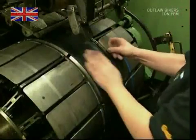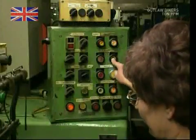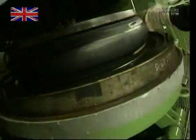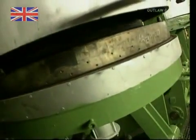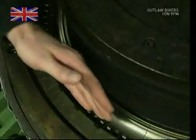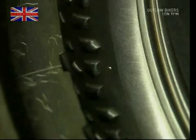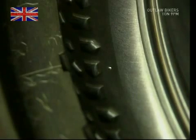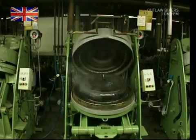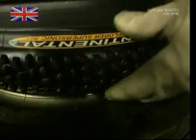But it's still not ready to be put on the rim just yet — first, it needs to be cooked. This cooking process is known as vulcanization. The combined elements are loaded into a machine that heats them up to 180 degrees Celsius for three minutes. This melts everything together, and at the same time it expands the rubber into the treaded grooves. When the timer goes ping, the machine opens up, and the finished tire is removed.